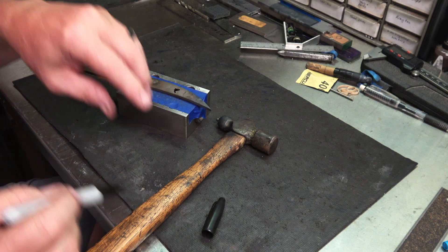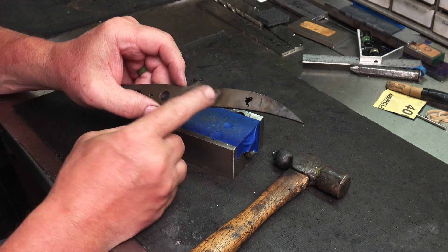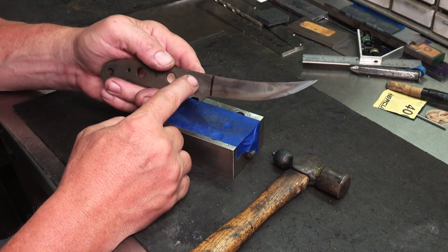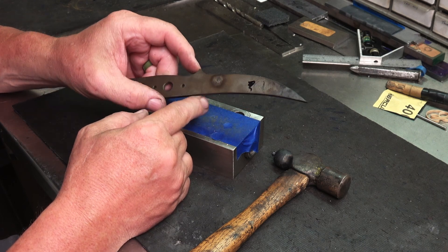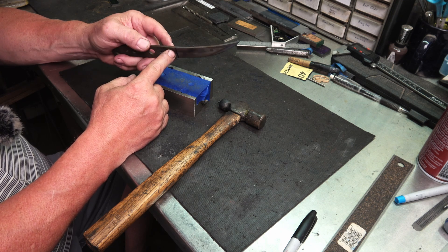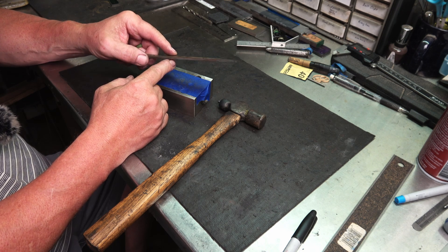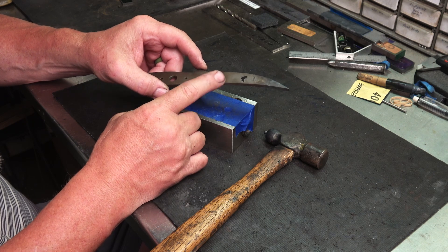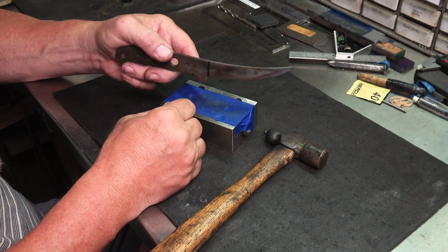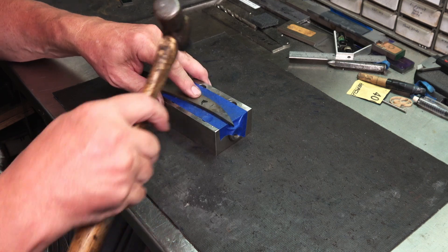Keep in mind: if your bow is back in the ricasso area, depending on the kind of blade you're working on, when you peen it you're going to make indentions that you have to grind out, or you'll have a bad-looking blade. Make sure you've got enough material to grind it out. Most of the time the warps I have are in the area where it starts getting thinner or narrower on the blade. So the idea is to come in here and just start peening.